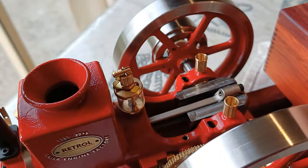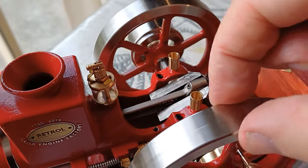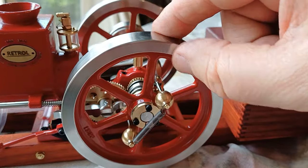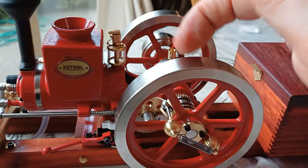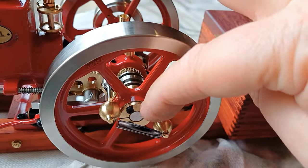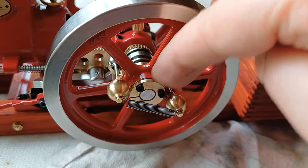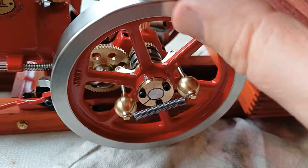This is a working hit and miss oiler. I actually really like the parallel faces of the counterweight there. And for the first time ever on a model hit and miss engine from China, we have a counterweight in the casting — and this is aligned on both sides. See? So they're actually lined up the way they're supposed to be on both sides, which is a first. A very discreet use of a self-centering holding-on mechanism rather than a grub screw on the side. This is better. And that's very discreet there — it doesn't look out of place.